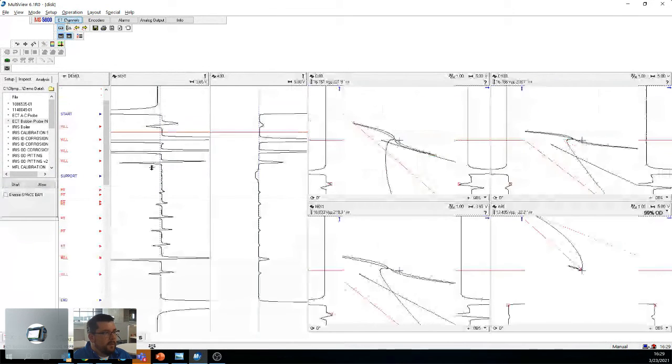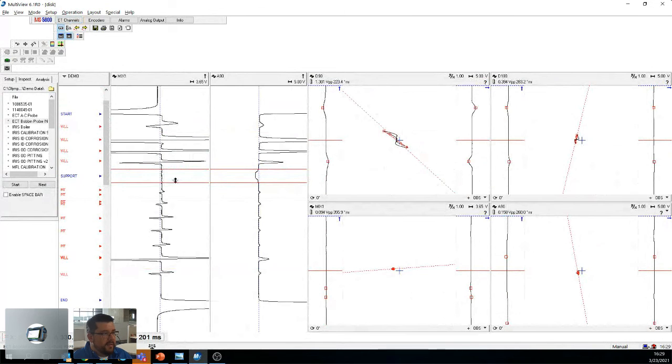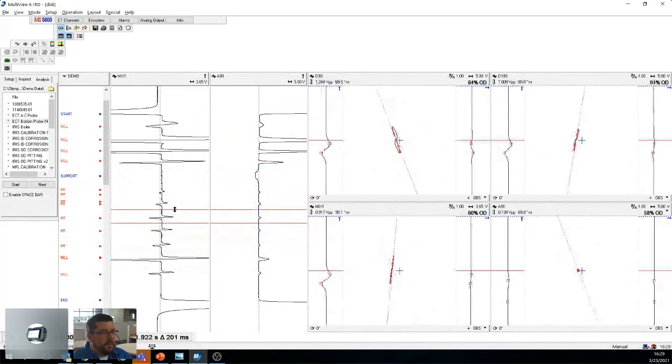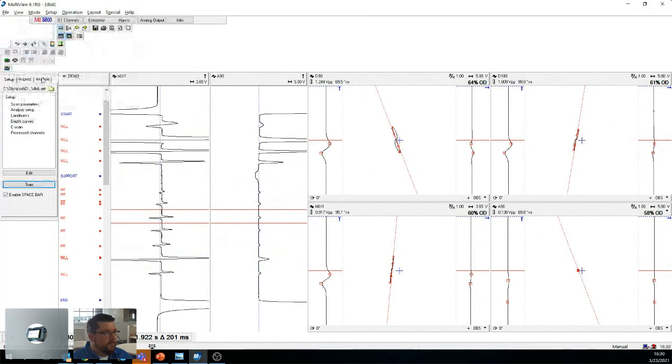So this one might have been brass, I would suspect. So the fact that it stays constant here, that we got the same thing here. We have a mix, which hides better than I did, because it did a better job with it, but it hides the support really well. You have all your defects everywhere that you need, same defects that you saw before. The reason these ones are giving us exact terms is because it was scanned once and they saved the data as is. So the depth curve, if I go here, the depth curve and what they see on screen is exactly the same, right? So that's A90, D90 is the same. Okay. So you're getting the exact same readings. Like for example, here around the 69.5, and I have 69.49. So that's giving us a perfect 60 FBH. Okay. So really doesn't matter what you're doing. If you're doing eddy current on non-ferromagnetic material, if you have the right probe and you have a support signal, you're golden.